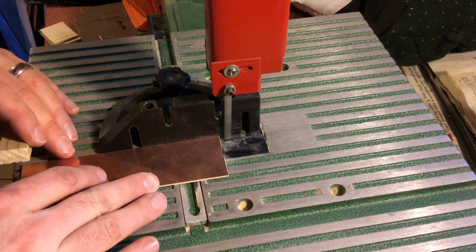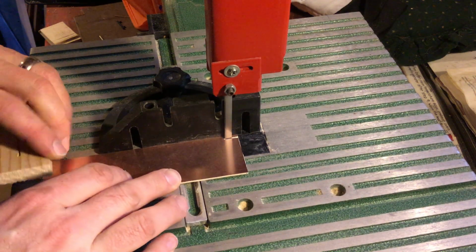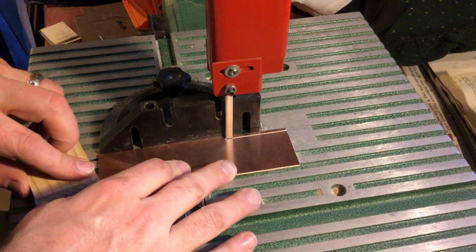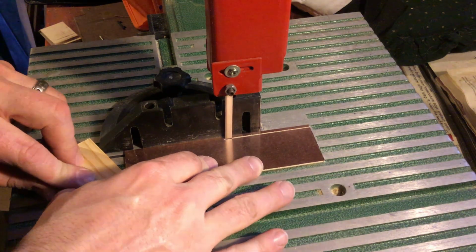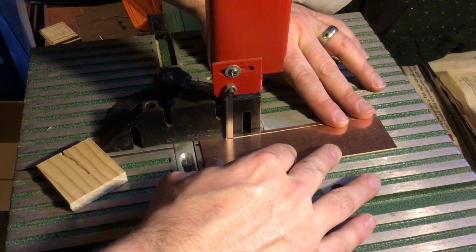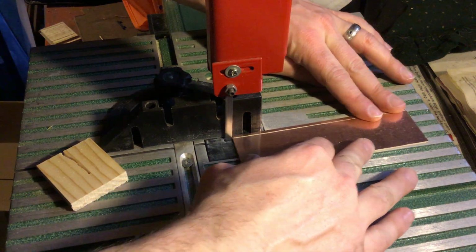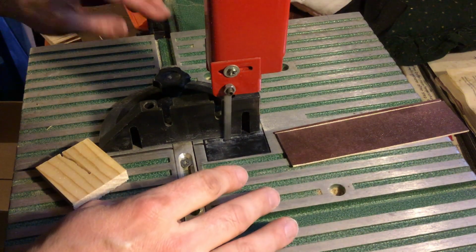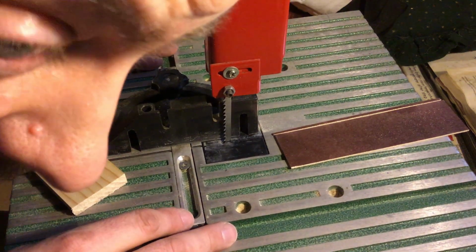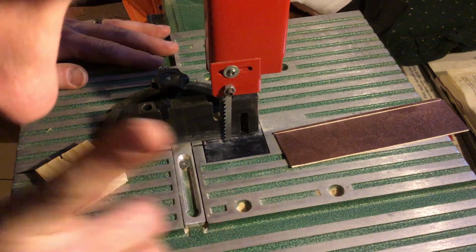The PC board can be cut just using a regular hobby knife, scoring it along a straight line, and then snapping the board to shape. You can do this. It does take a while. It does dull your knife. Can be done. I'm using a bandsaw simply because I happen to have one available to me. There is no shame in making use of a mechanical advantage.